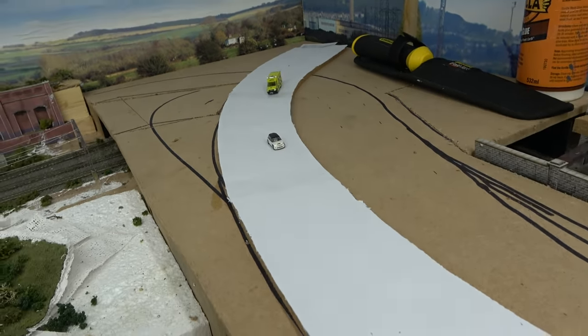It's not looking too bad. I see the Mini is driving skew with a little bit. I think that's because the magnet only sits on one link. So yeah, if we look at this slider, it's so small that it only sits across one link, which means any fluctuations in where the link is actually sitting, like whether it's going straight or skew with, whether it's slack or tensioned, is going to affect how the car drives.